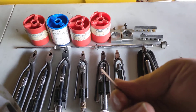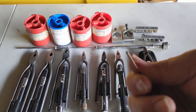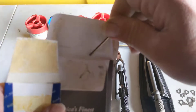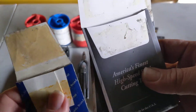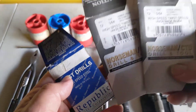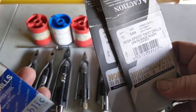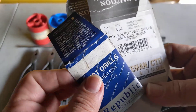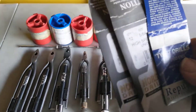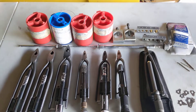Regardless of the size, I tend to use titanium or high-speed steel bits, and I've had to get American-made ones. For most drillings I don't care where they come from and they usually work fine, but these small bits for safety wire need to be almost machine quality — American-made are the only ones that have worked for me going right through bolts. I literally had a huge stack of broken cheap drill bits, but with good ones I can sometimes drill half a dozen or more bolts, drilling in three different axes each.